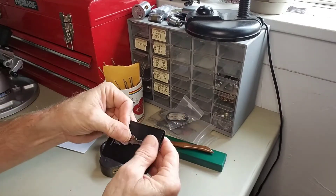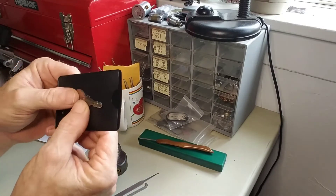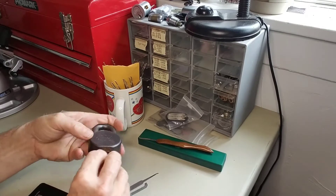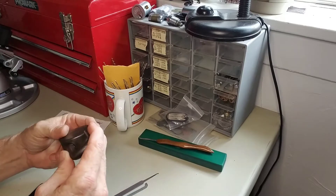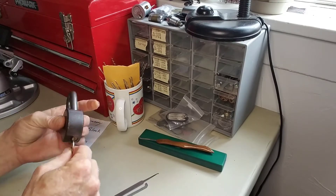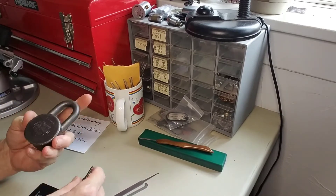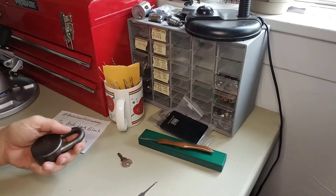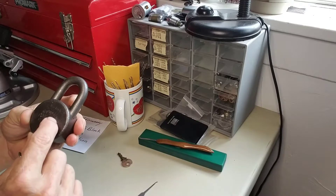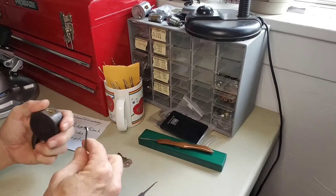Here's the key on it — it's a double wafer lock with a kind of cool shaped key. You don't see many of them with that crazy bitting on wafers. It works great. We'll gut this guy real quick, and some people may not have ever seen a wafer gutted before. It's got a double ball locking mechanism. There's just something about this little guy — he's definitely seen some stuff in his time to be that beat up. It says American Lock Company, Chicago, USA, Patent Pending, and it's got an H747 number on there. Just pretty plain, but I like him.